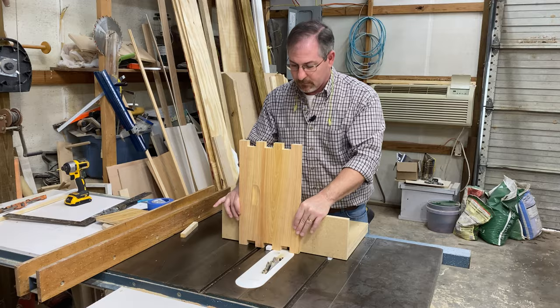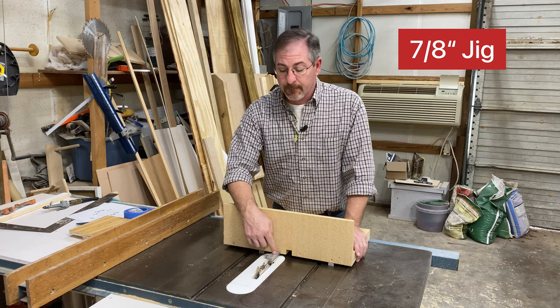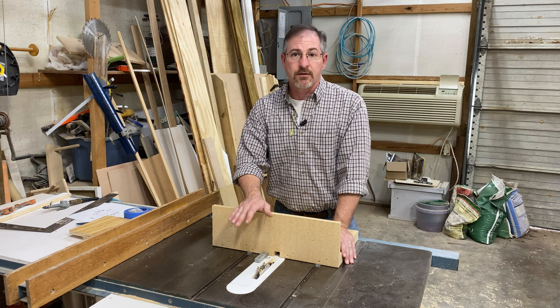Our jig for our 7/8 inch box joint will be very similar to our 1 3/8 jig with a few dimensional changes. Our first dado cut that'll hold our 7/8 reference peg will be 8 5/8 from the inside edge of the blade back to the fence. Then we'll shift the fence over 1 3/4 inches to make our second. And you'll be able to find all of these dimensions in the drawings, and I'll be sure to leave that link in the description.